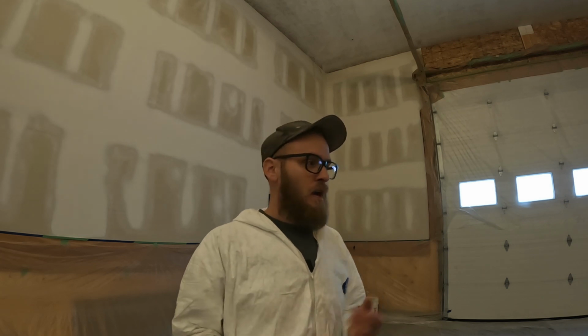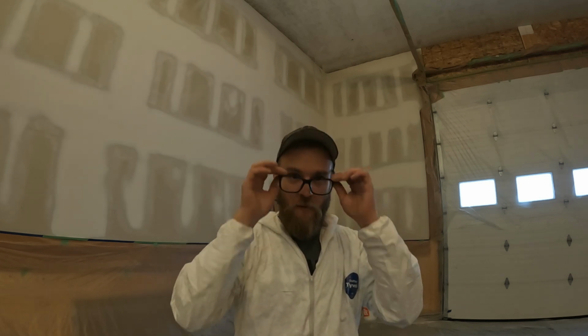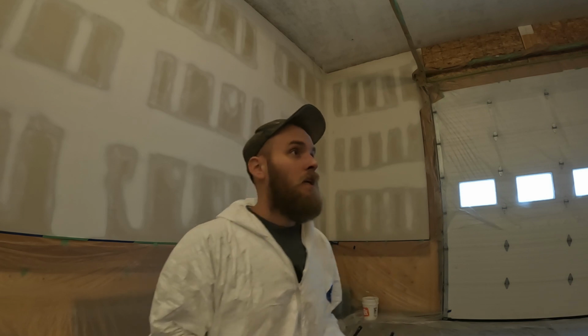Much debate about the back roll because it takes time, and time is not always a commodity you have in excessive amounts. But the back rolling will eliminate any sorts of runs or smears or screw ups. From my reading, my understanding is that when you just spray with an airless sprayer, it doesn't promote exceptional adhesion on the first coat. You're gonna have pores or holes or gaps or cracks that you cannot see very well. I can't see very well most of the time. The back roll forces the paint into the drywall and really helps with coverage.